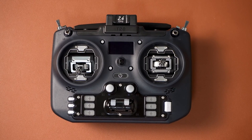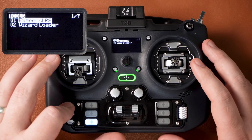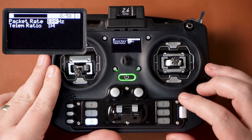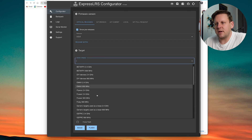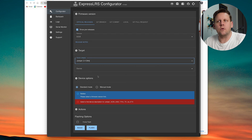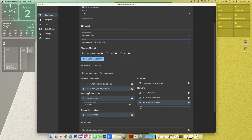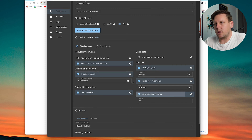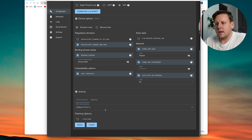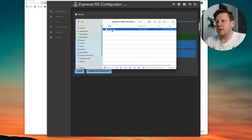Now I'm going to show you how to flash ExpressLRS via WiFi. The first thing we need to do is go into the Lua script — hold down the menu button and go into the Lua script. In the ExpressLRS configurator, select the latest version and go down to Jumper in device category, selecting 2.4GHz or 900MHz as appropriate, then select Jumper Gemini T20. It doesn't matter whether you select Edge TX passthrough, UART, or WiFi since we'll need to enable WiFi anyway. Set up your configuration as before and click build. The configurator will build the firmware and pop up a window — drag firmware.bin to your desktop.